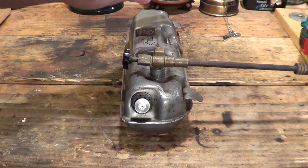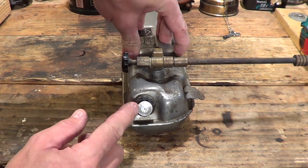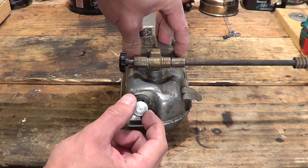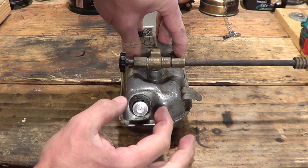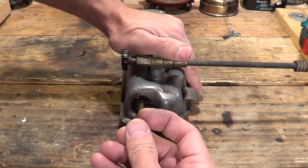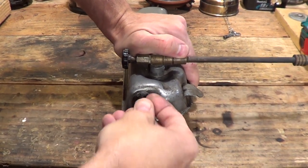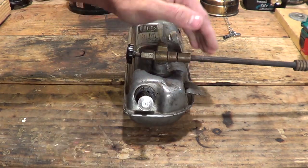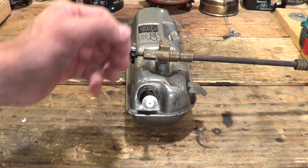But sometimes when you don't close this tight enough — and it's very rare that I see this, but on this tank it's a good example — when I loosen this, listen and you'll hear air escaping. Hear all that air? As long as my thumb is over the hole it's fine, but that tells me we have a faulty check valve, because you should never get air pushing back out of this little hole against your thumb.